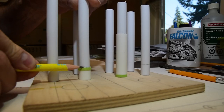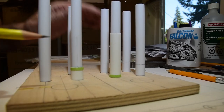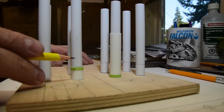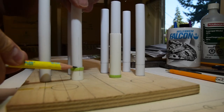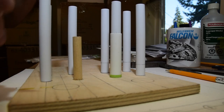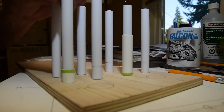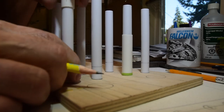So here's my spacer on my pole on these concrete riser columns for the gates. I need consistent marking, glue points or drill points, for all my bracing. So I put this little collar here, slip it over top, put the pencil there and just turn it on the wooden dowel on the jig. Just like that. There's the line. Slide it over the next one. There's the line.